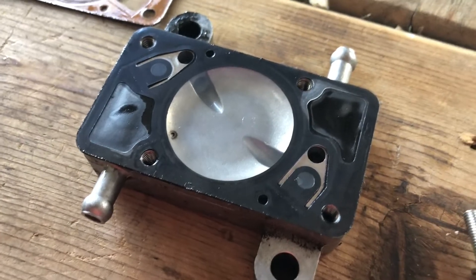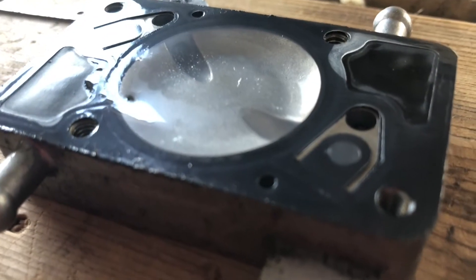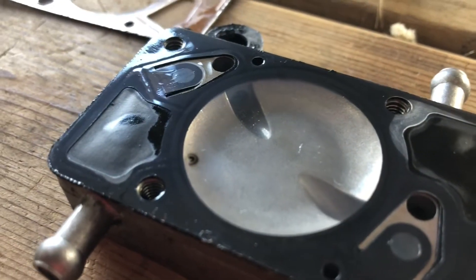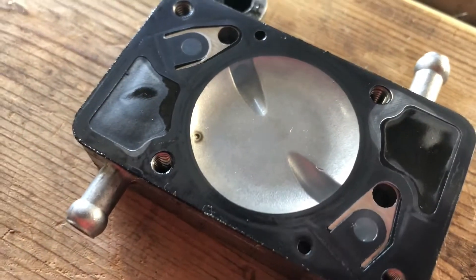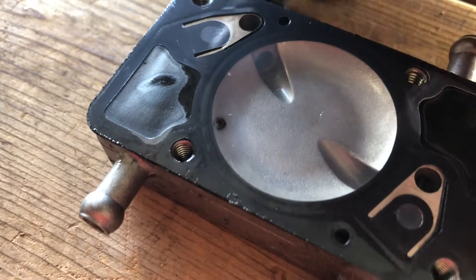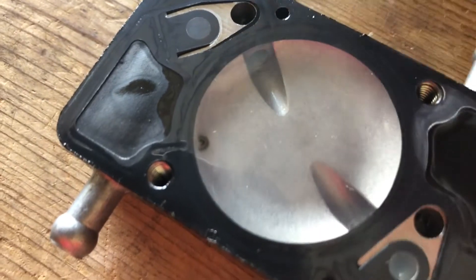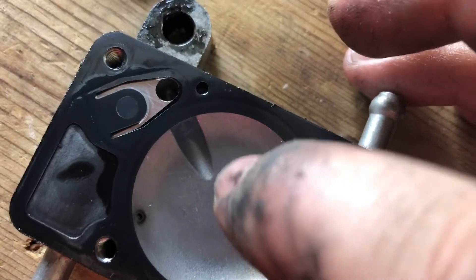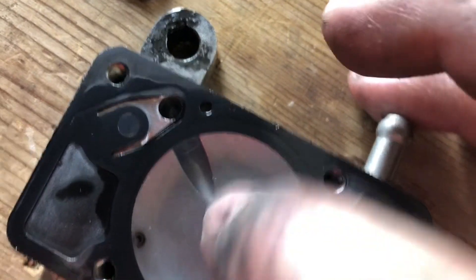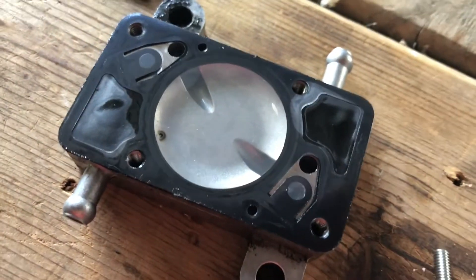We're back with the Mikuni fuel pump — the pulse-based suction fuel pump from my Rotax 447. As I reported a moment ago, I don't see any big tears or rips. But one thing that is kind of suspect — if I can point to it with this rivet mandrel — it's got a little halo of something in there. I don't know if that's a puncture or quite what that is. When you tap on the diaphragm, from certain angles you can kind of see. I did see some fuel here, but now it's not doing anything.